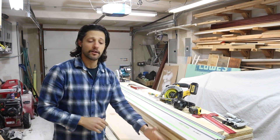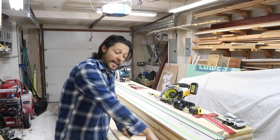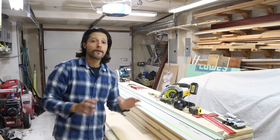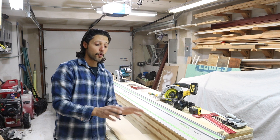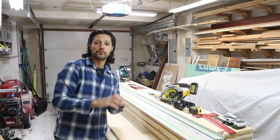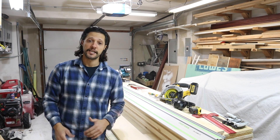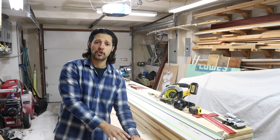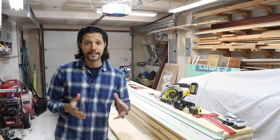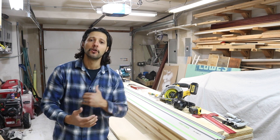After striking my line and seeing that the lines are nice and even on both sides, you can double-check your work by going along the edge you cut and backtracking a line down the reference edge — you'll see the lines are exactly the same distance from edge to edge. The most important thing: reference yourself on the long edge of the board. Get a nice straight edge on the long grain, make the other side parallel, then square off your ends. As long as the lumber isn't completely twisted and warped, those straight edges will give you the perfect finish you need and you won't be chasing your tail.